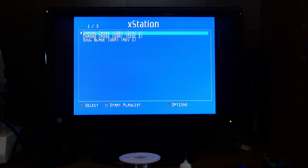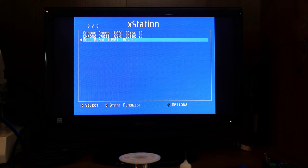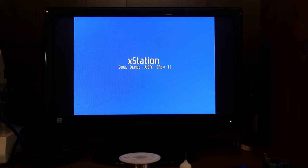Okay, so I just have a couple games here just for testing purposes. So to do a proper test of the Retro Gem on the PS1, you need a game that has some kind of FMV cutscene, and then you go into the test menu and you've got to activate the self-test option while that FMV is playing. So I always use Soul Blade for this because it has an FMV right at the beginning. So let's go ahead and load that game.